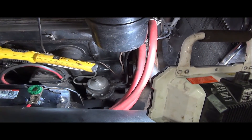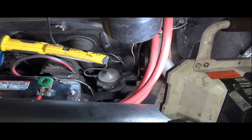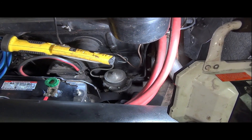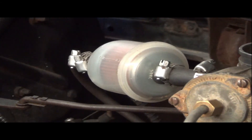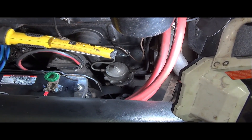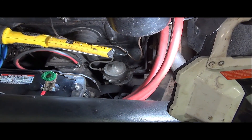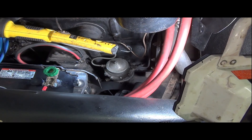It's a new day of Buick wrenching. We're going to take off the fuel pump — it's a fuel and vacuum pump combination unit. To recap: the car stopped delivering fuel, no longer pumping it through to the clear fuel filter. It was running correctly before. I filled it up with more gas just to make sure I hadn't simply run it empty. I don't believe we have any massive leak between the fuel tank and the pump, so quite possibly the fuel pump has failed.